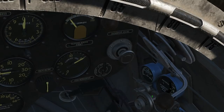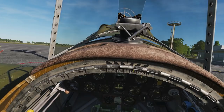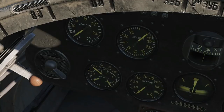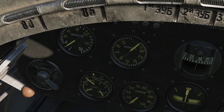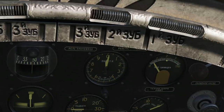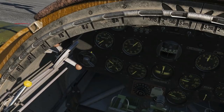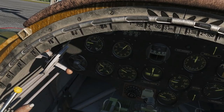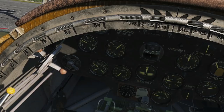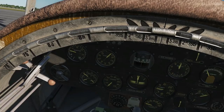The only other thing is that we need to leave the bird — like the other warbirds — to warm up. We've got the oil temperature gauge here, currently about 20 degrees centigrade, and it needs to be at least 50 before we start running the engine hard. We've also got our exhaust temperature here — make sure we don't go above about 210 degrees. So we're going to hold the brakes and accelerate to an RPM of about 1100 to let it warm up. Okay, the bird is warmed up and we're ready to go. I hope that helps and see you later.